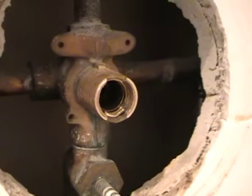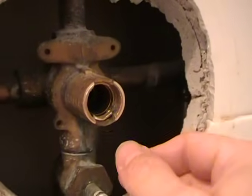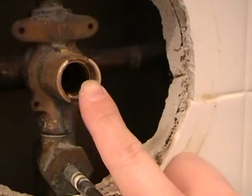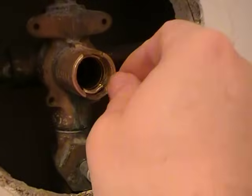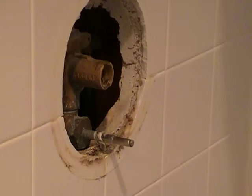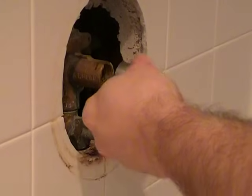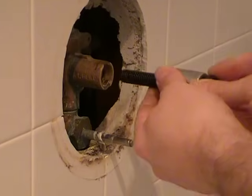So instead of torquing on it, someone suggested we just adapt a puller. However, that's not going to work if these ears are still on, because you're just going to be pulling against nothing. So one comment I got was to use the bolt like we did before, except use a socket to make a puller out of this. So it seems like that might work.